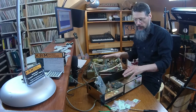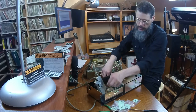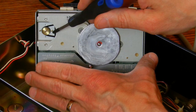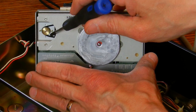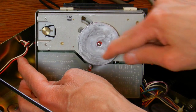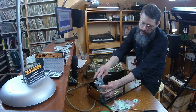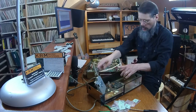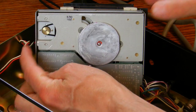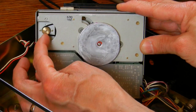After I disassembled everything, I reconnected the quick disk drive and flipped it on its side so that I could see the mechanism on the bottom. It became apparent right away that the drive belt is quite loose. If I move the drive wheel, I should see the flywheel moving as well and the mechanism should move, but instead nothing happens. There's a quick disk in the drive right now, so if I hit the load button I can see that the drive wheel is moving, but the belt isn't catching.